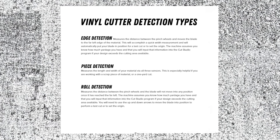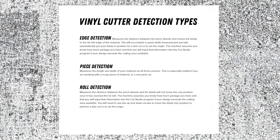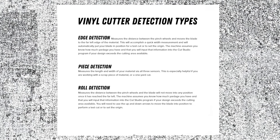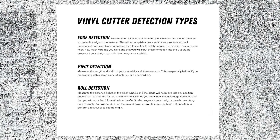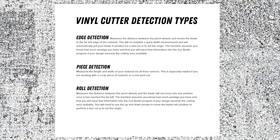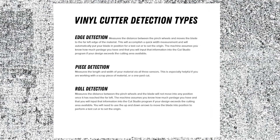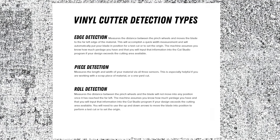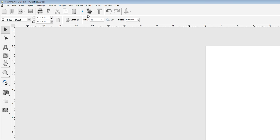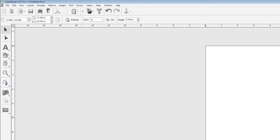Here's the biggest difference between this plotter and one you'd pay thousands for. Commercial machines have an optical sensor embedded near the cutter head that detects the end of the vinyl, letting the machine know exactly where it ends — so your X and Y will be auto-homed to your workpiece. Some even detect the position of the pinch rollers to detect material width, and that data is auto-applied to your cut software. This is a nice-to-have feature that's totally unnecessary; as long as you enter your material width manually in your cut software and set your Y origin manually on the machine, you're good to go.